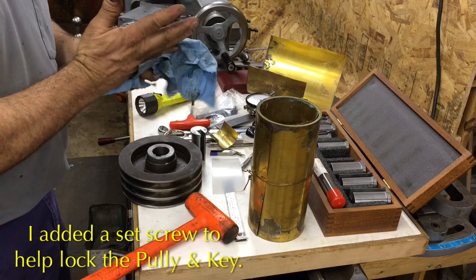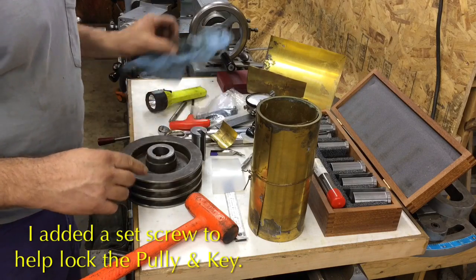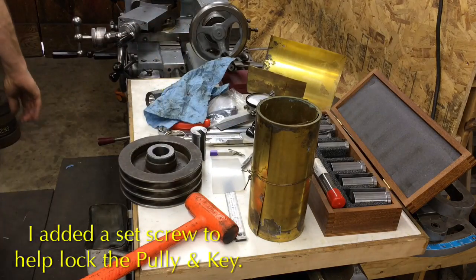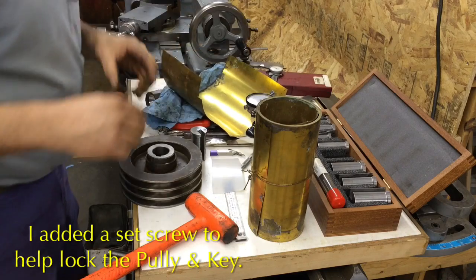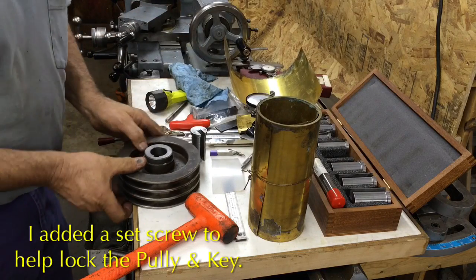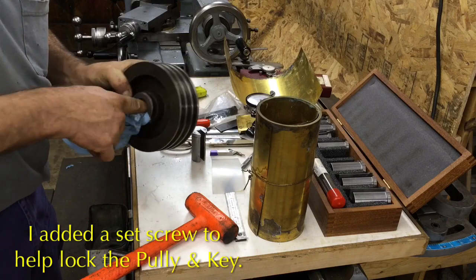I have the flexibility — I'm going to cut the key on the shaft and I'll make it a little bit deeper, or I can fine-tune the key. I'm not too worried about it; this is like 10 thousandths. Being pushed back 10 thousandths isn't going to make a difference. See if I can show you what it looks like and how almost all of the beat-up part is now gone.